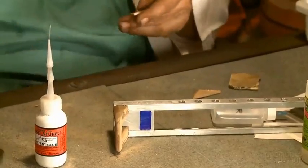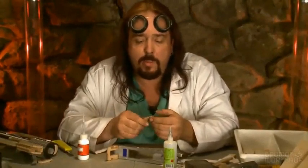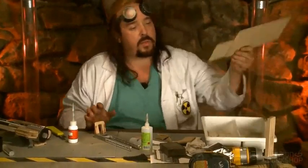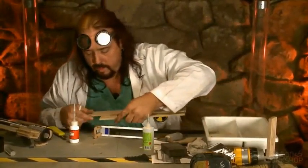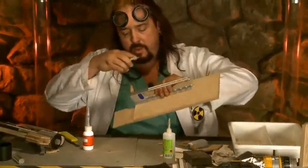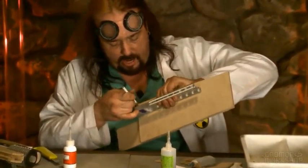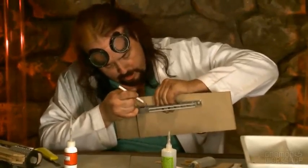And how you do that is you can go ahead and cut out your part. Usually what I like to do is you can either take a pattern from a piece of styrene, cut a piece of material, kind of fit it, figure out what your angle is. What I like to do a lot of times is, say if I was going to put that angle in there, I take my pencil, and I lay it in the general position where I want it to be, and then just take a stencil off of it like this. So that's my angle, and say I want the thing to run from here to here where this line is. So I just mark that.